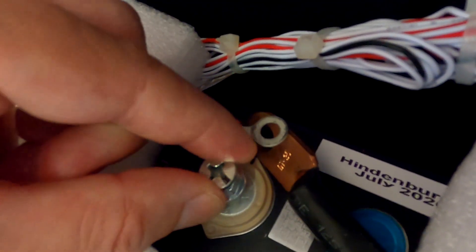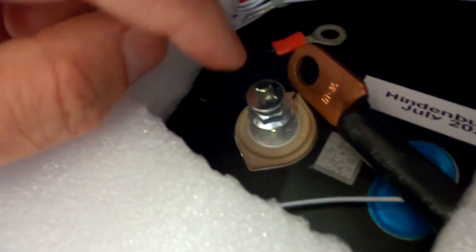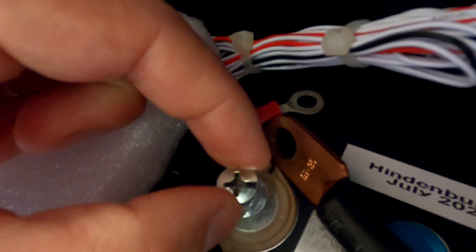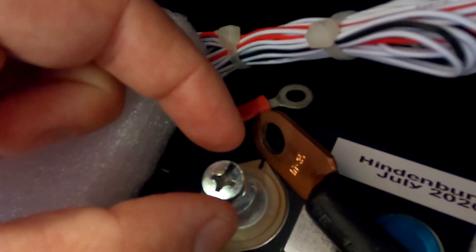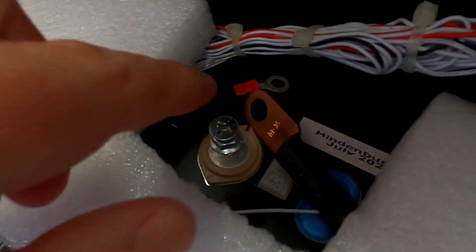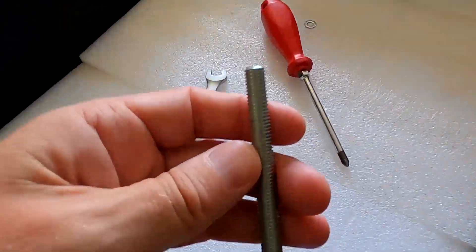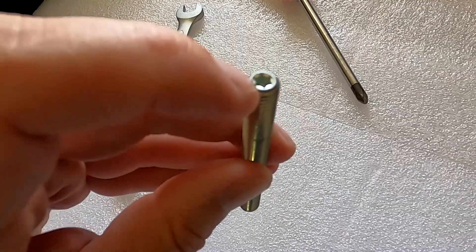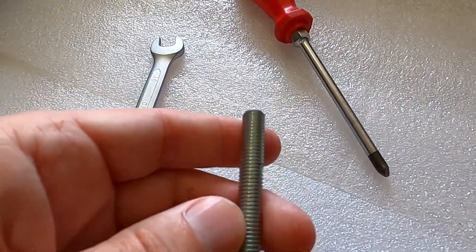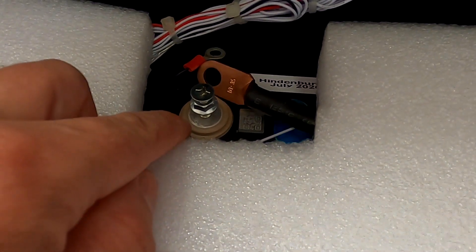I screw it in all the way, then turn it half a turn counterclockwise. There's a mark on top of the screw and on the terminal — when they line up I know I'm just over. So I'm using the full length of the thread but not pushing into the terminal. Then when you tighten, hold this with your screwdriver and use a spanner to tighten the nut — no pressure on the actual terminal but using the full thread length. Some people suggest buying threaded rods with an allen key head — they work too, but I had plenty of these screws already.